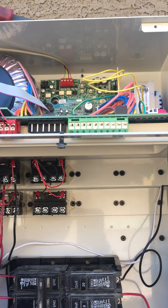Once I get it programmed I'll show you everything else. The rest of the 10-pin: LVH is your heater. Solar — I wouldn't worry about that, it's a temperature sensor for solar and you guys probably haven't run solar and won't anytime soon. 10-pin 5 and 6 is for your water temp sensor, 7 and 8 is for freezing air, and 9 and 10 is spare — we never use those.